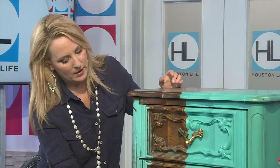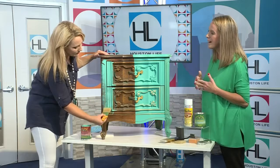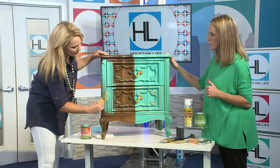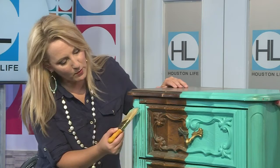What happens if a piece stinks? Most of them do — they're old furniture. You can get most smells out. Cat urine is the only smell I've not been able to get out; I've just tossed those pieces. But I use shellac — shellac gets rid of all other odors. It's a clear primer that traps the smell. Whether it's cigarette smoke, house fire smoke, that musty smell, or mothballs, shellac will actually block that odor for you.